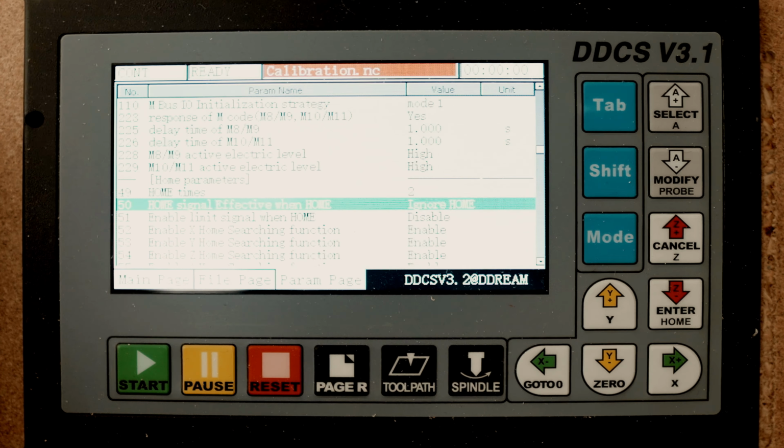Here I use current position, and that is because I will place my tool, and my new tool will probe on a special area, and from that area, it doesn't matter where it goes, out to the X or to the Y, there will be plenty of space for doing this automatically, zero set of X, Y, and Z. So current position is really good. Back distance after probe, it will lift 5 millimeters.